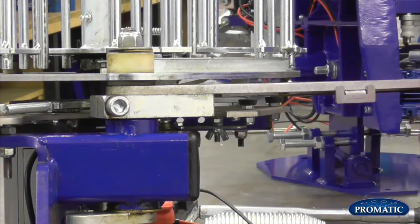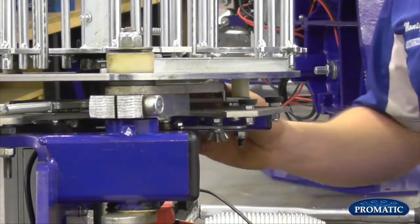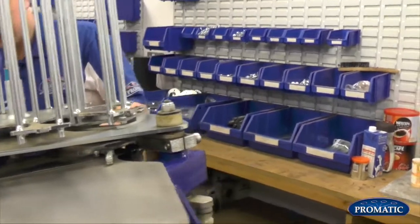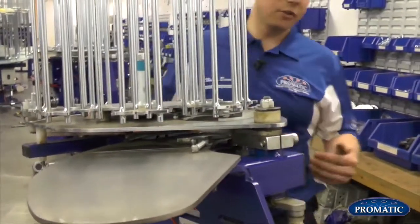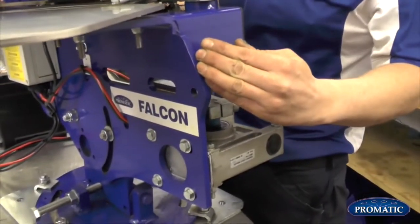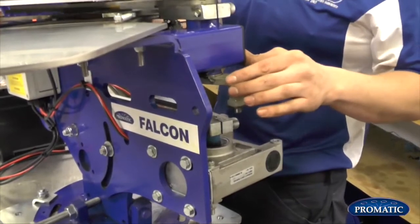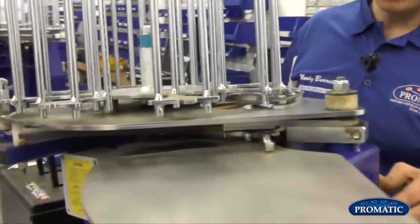The other way to do it is when the spring is on. If we've set it correctly there, once the spring is on, we're looking for the machine. There's no spring on this one, obviously, but as we bring that around, we're looking for the trap to fire when the arm goes over the centre of the frame. So the centre of the frame is basically here. As that comes round there now, I would expect that machine to fire if the arm timing is set correctly. If it's not set correctly, the machine could potentially fire there, so it's firing at a later period.